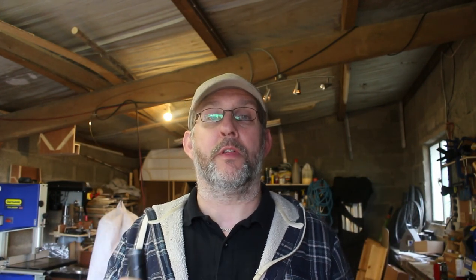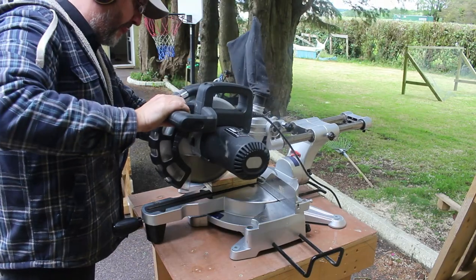Okay, so those boards are all glued up now. The next step is we need to cut those panels down — there's a five degree taper in each board so that the finished box will look like that, not just a square box.